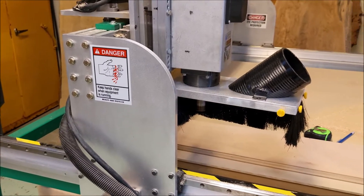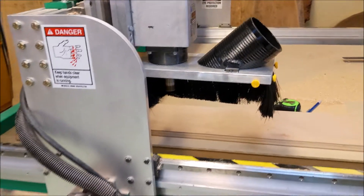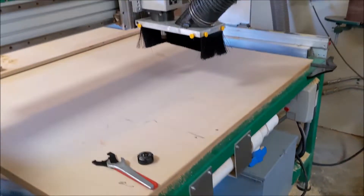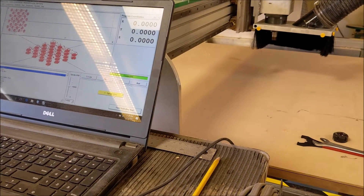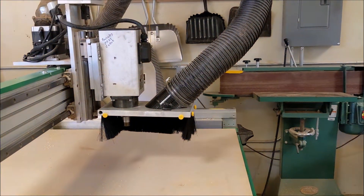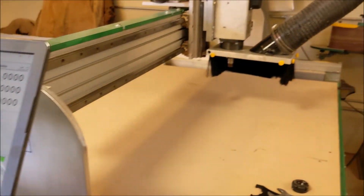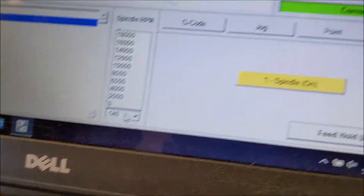It is quiet. So that's full speed right there — 18,000 RPMs. But this is quiet. Spindle's all in. There's the inverter wired in. Missing a collet still; I have one on order. Can't even hear it running at 10,000 RPM. Turning it up to 18,000. It's going to help a lot with our programming of feeds and speeds. You can also just set the speed there — there's 140 revolutions per minute.